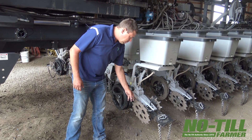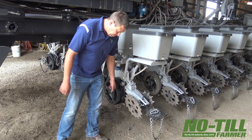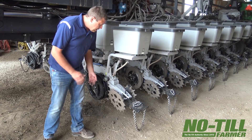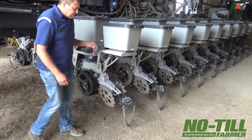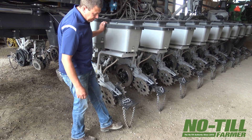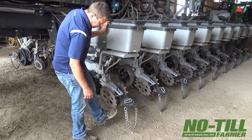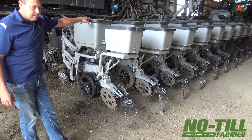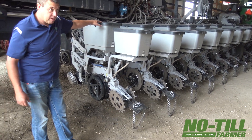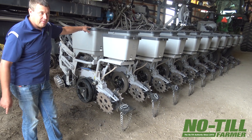Going right back to the closing — traditional V-closing style is what John Deere and everybody's used for a lot of years. With a SI finger-till wheel, we went with the drag chains just because they extend out a little bit and keep them from bouncing up over, because we thought as aggressive as these wheels look they would love the grab chains. But I don't believe they grab at all — the only thing they grab is your pant leg on the way by.